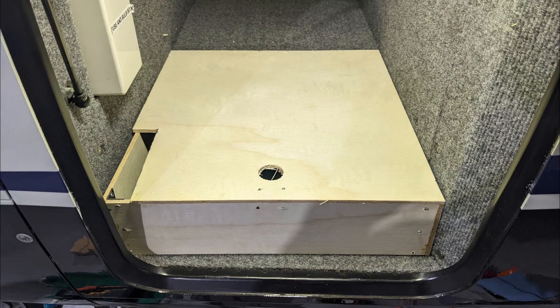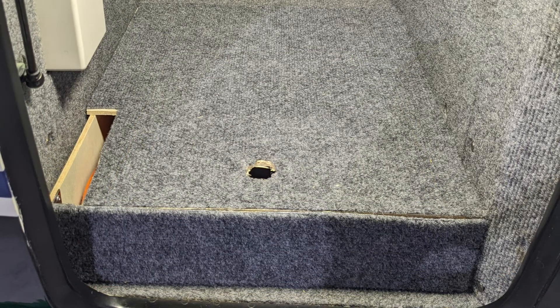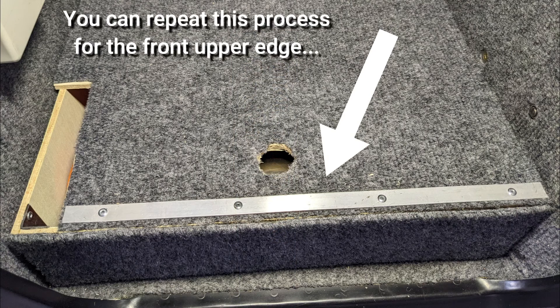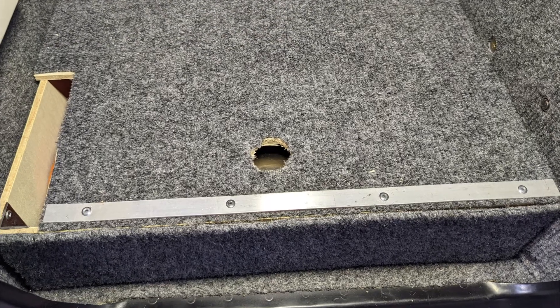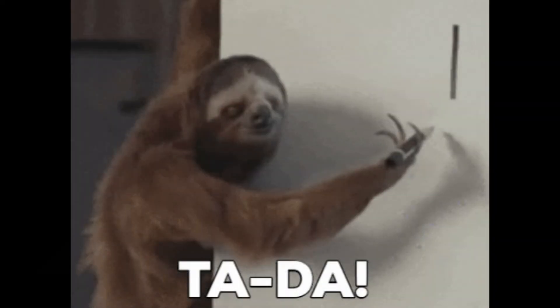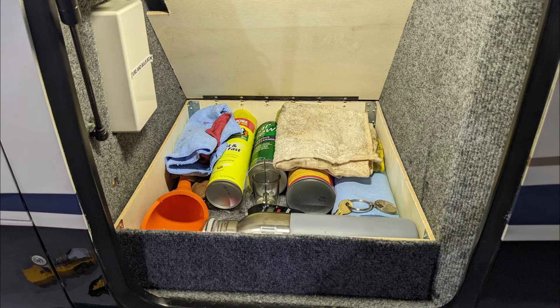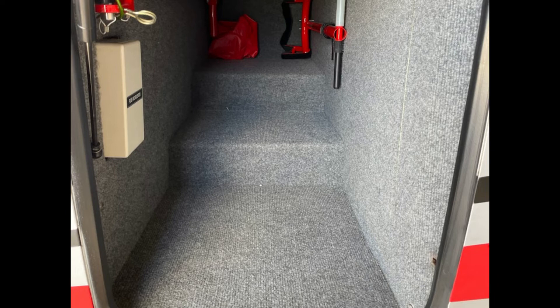Back to the good pilot stuff. Using wood glue, spread a thin layer on top of the box lid and lay the cut carpet piece on top. Do the same for the front carpet piece. Now cut the flat bar to exactly 13 inches, lay it on the front lip of the lid, mark four drill areas evenly spaced, and attach using four long rivets with the finished edge against the flat bar. This will protect the edge of the carpet from fraying and pulling up. That's it! You should now have a finished storage area — great for rags, cleaning supplies, spare oil in a sealed coffee mug, and an oil funnel. The box should be the same height as the first TBM step, so you can easily slide carry-on luggage. No more TBM two-step. Enjoy!